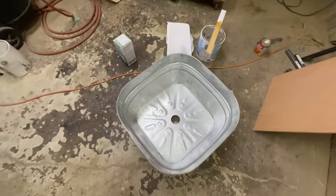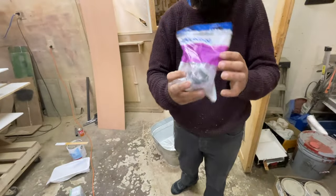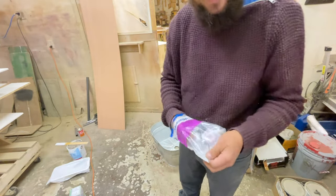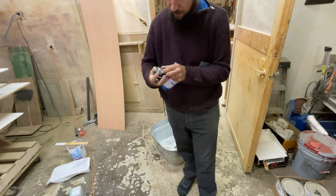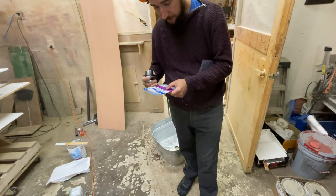I just cut the hole for our shower pan, wash tub. So this is the bath drain, shower drain that we purchased. Bathtub drain assembly. Just gonna make sure it fits before we go ahead to paint. It's a push button plug that goes down the hole. And then I think this is a 1.5 inch fitting. Yep, 1.5 thread fits with tubs.